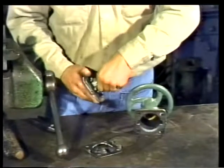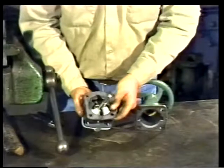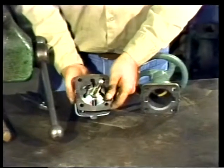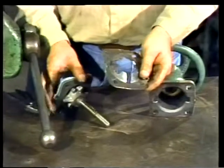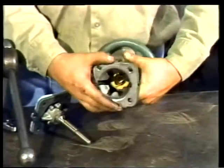When the diaphragm, compressor, and stem are threaded into the bonnet, the compressor will have to be aligned with the finger plate, as you see here. The compressor is also aligned with the tabs on the diaphragm.